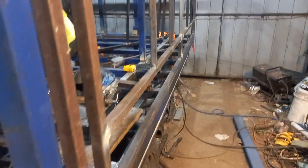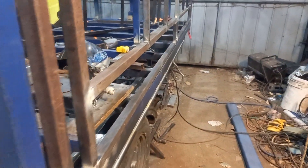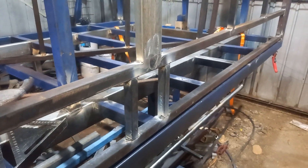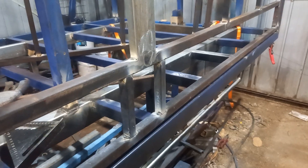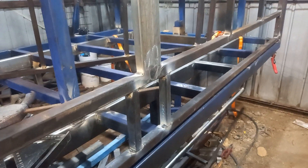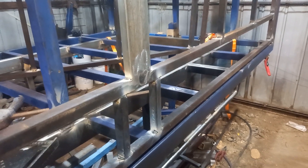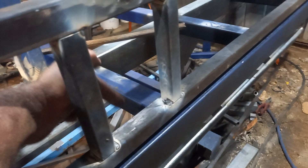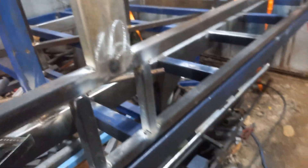We've just got some 30 by 30 by 1.6 to create the door. One handle on the door — I'm a big fan of one handle, I don't really like two. And then we just have pins that run either direction and they lock, and obviously we'll have another pin that runs down here, so it's three locking points.